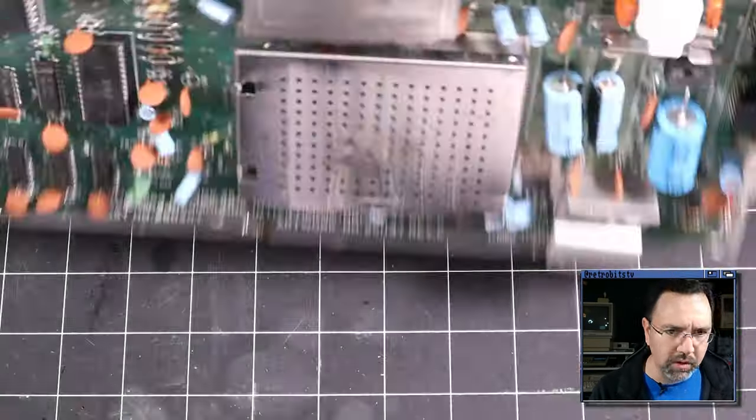One thing I forgot that we should always check before we troubleshoot anything else is the reset line. We want to see that that's working properly. And if we look here on the CPU, here at pin 40, we can see we've got the reset line. It should normally be held high, except when the machine is in reset, and then it should be dipping low for just a second. So let me get the probe onto pin 40, which is the very last pin on the CPU here. And I will flip the power switch, and what we should see is that it should go low for a second and then flip high. Yep, that looks good. One more time. Yep, okay, reset line is working, so we've eliminated that as a possibility as well.